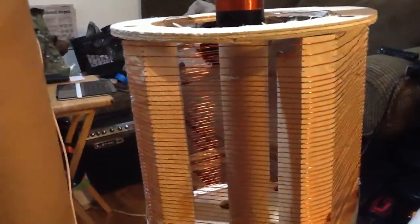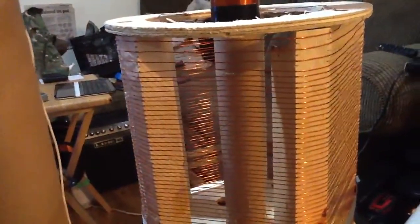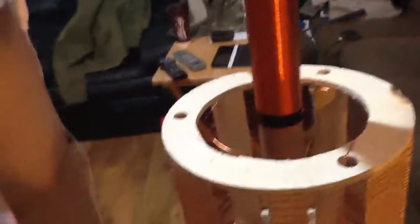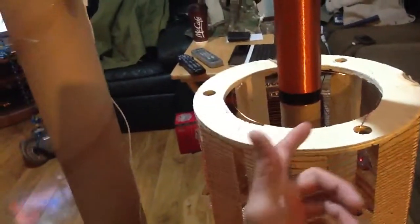This coil actually starts about right here. These windings are not used. It's just the two-turn primary. Then the secondary starts here and goes up, spaced out on the last few turns at the top — just because I've seen Tesla's own work look like that. I'm guessing so you can lift or lower one turn slightly at a time to change the inductance ever so slightly. And then the extra coil, or magnifying coil, is just coupled directly to that, going up.